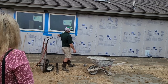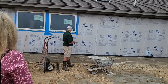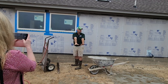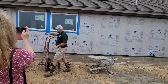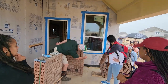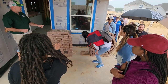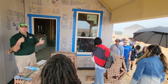So when they tape these windows, there's a certain process it has to be taped. They do the inside first, they're going to set the window, they're going to do the sides, and then they're going to do the top, so that way water will always shed to the outside. They've done an excellent job here — they got a little bit lazy here because they didn't use the holes that were already there, they just went ahead and put in the nails where they wanted to. The thing that causes cracking is if they use those really powerful guns — BAM — it just cracks that plastic.